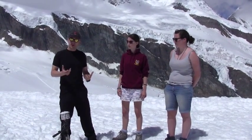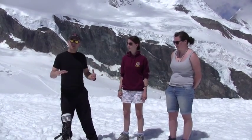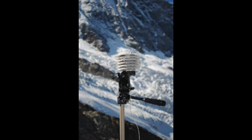Because of course we always measure air temperature in the shade, and we're clearly not in the shade here — our skin is open to the elements. A radiation shield to cover the sensor is essential. Direct contact with solar radiation will warm up the metal probe and give rise to inaccurate readings. It's important that the sensor is vented to allow free flowing air to pass through the sensor.